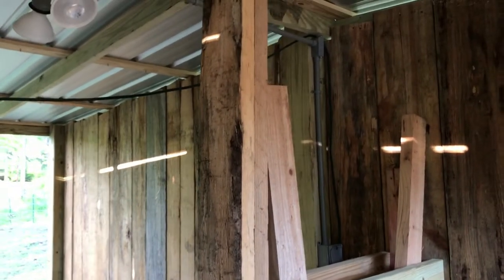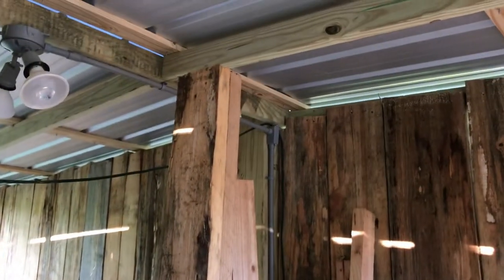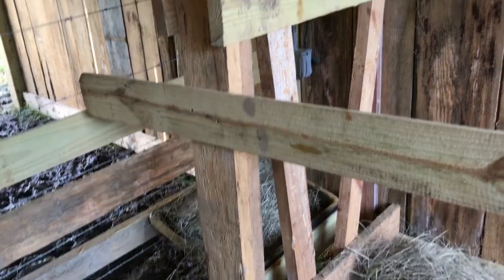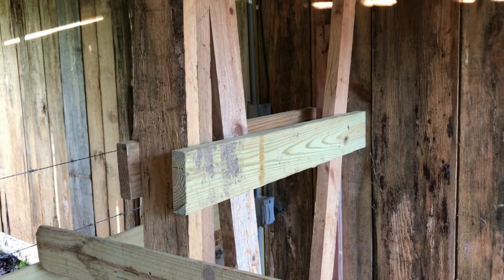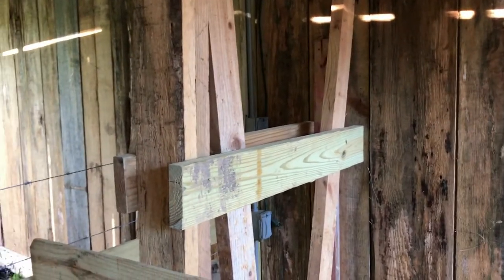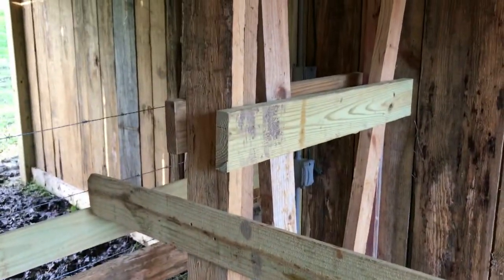The structure is all built out of the same material. You see the bracing right here — I've got about a foot and a half in the ground, concreted in, and I've got a double board. You could use a four-by-four or six-by-six, but we used a two-by-eight post and just put two together, so now we've got a really big beefy post. It goes all the way up and all the way down — concreted in. That's the main support of the whole stanchion.